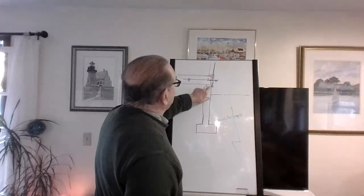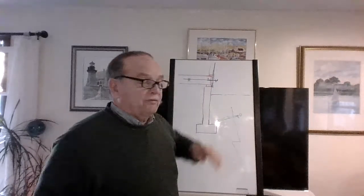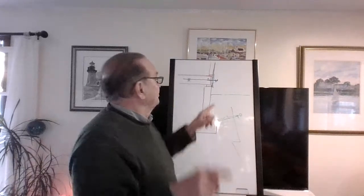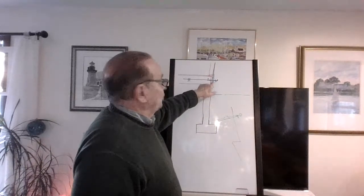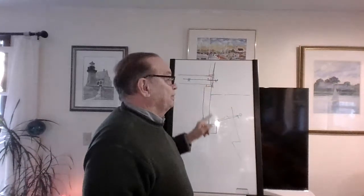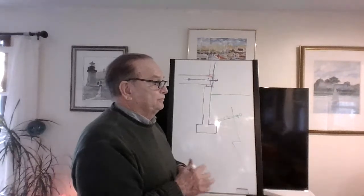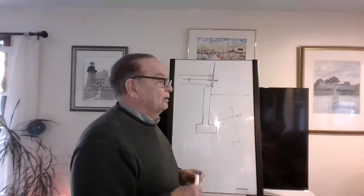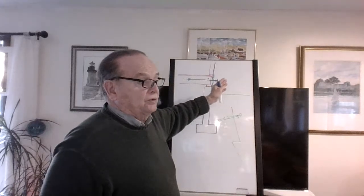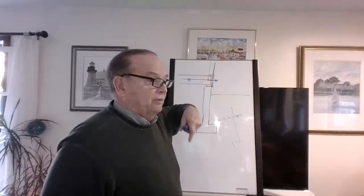What you need to do is to ensure that you're feeling the top of the foundation wall. Then go in the cellar. Look for a window. Measure from the window to where you're going to be. Now, obviously, before you went in the basement, you checked it out from the outside. Go in the basement and look where you're going to be drilling through. Are there any maybe electrical lines? Or worst case, how about the service for the house? You hadn't noticed it. Maybe it comes in maybe one bay over and cuts by here and then down to the meter.